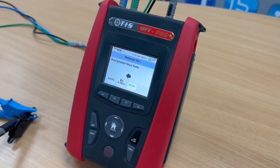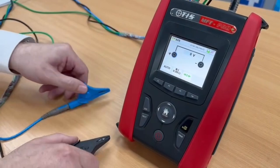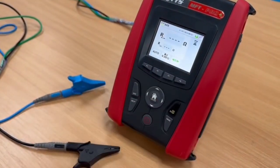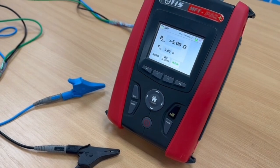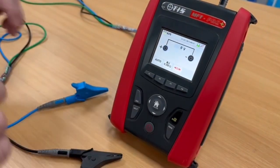So how do we remove that? We press the back button, we open up the leads so that they're totally apart, press zero — calibration reset — it's confirming it's done that, and we press the back button again.